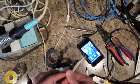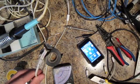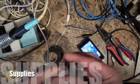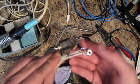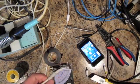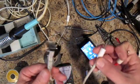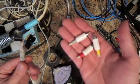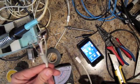You're going to need a soldering iron, solder. I like to have a continuity meter to check to see if things are working. The supplies you're going to need are two female jacks: one quarter-inch mono jack, a stereo female eighth-inch jack, and also this wire — this was originally a quarter-inch or eighth-inch jack to three RCA male connectors.